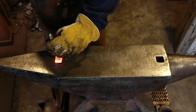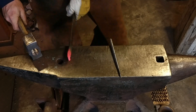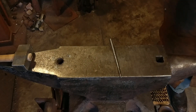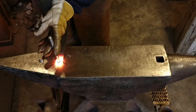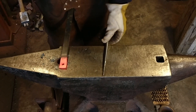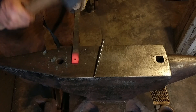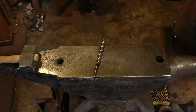This is a pretty simple process, and this is just trying to illustrate what this style of drift will do for you. As I mentioned in the other video, this drift needed to be fairly long and have a very nice, even taper in order to not stress the sidewalls of the hole as you drift it out, and to create a nice, even-looking hole. It just makes things slip through a lot easier if the drift is done very nicely.